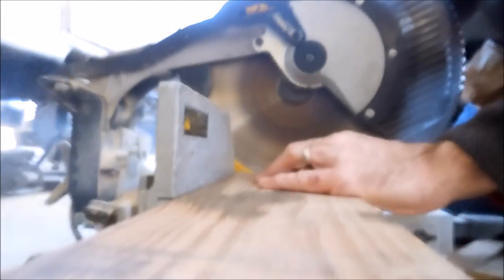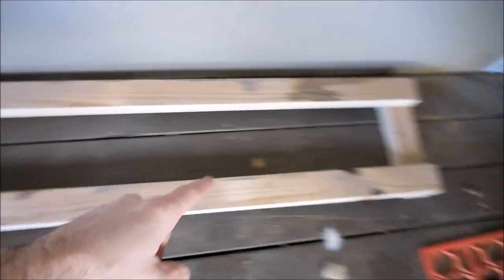Now we're going to cut our feet, and they're going to be one foot. I'm going to use the rest of my 2x6, cut it in half, and then it'll be a foot long — that's going to be our feet. I may put one in the middle. The design is I'm going to have taller boots in the back, shorter boots in the front, so my dowels in the back will be taller, and that way the shorter boots can fit up under it and they won't hit each other. I'm thinking for looks I'm going to cut a piece to go in here so it'll all look flat, but that piece wouldn't be necessary — that's just for looks only.